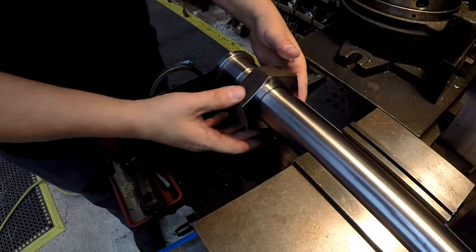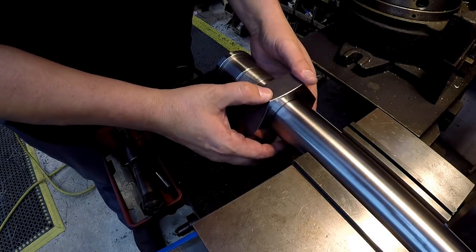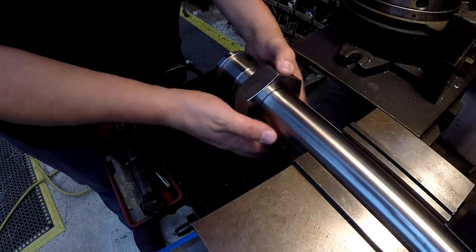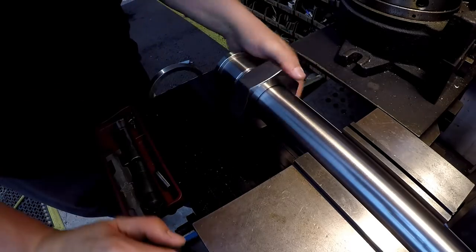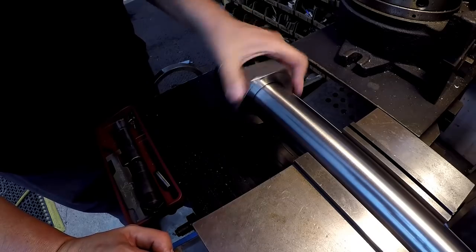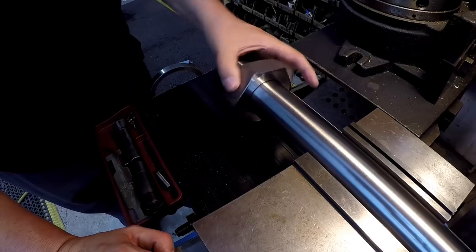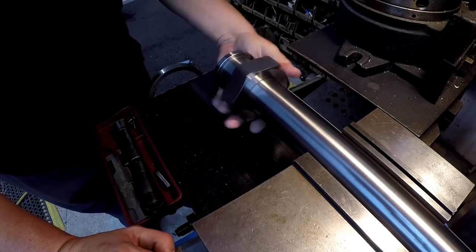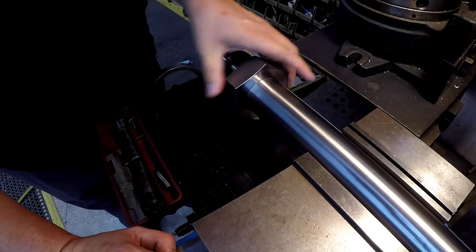Okay, I've been working this fit on the nut and the bar, and I'll say that this is definitely a machinist fit because I have no room for play at all. I put a little cutting oil on the threads, and when I spin this on there, there's no movement for it to just free spin. I mean, it's just very little. It's on there. There's no rocking. So I really needed a little bit more clearance than that, but I think this will work.